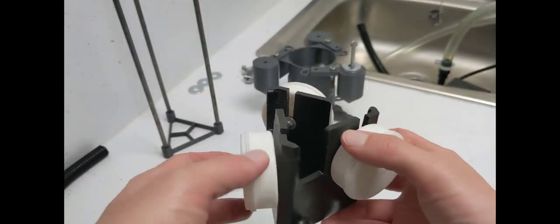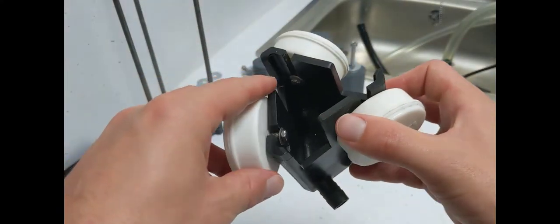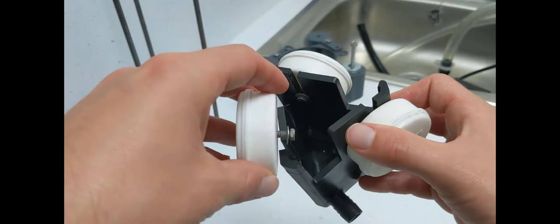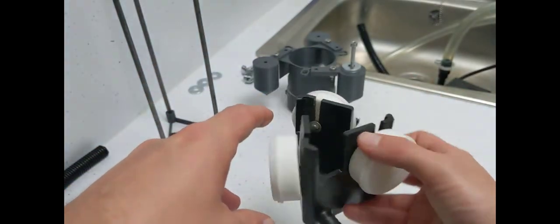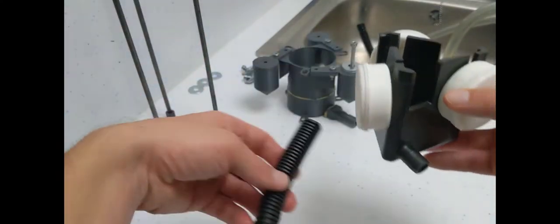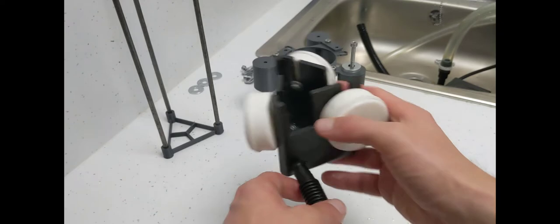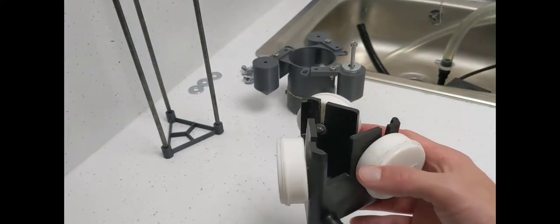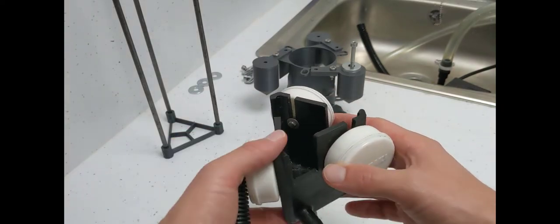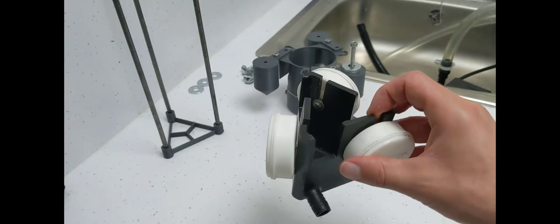Instead, having the outlet on the side means the vortex goes down and sideways, and it just doesn't work — you don't get a strong vortex. The floats are also poor quality. Most other models are triangular with an outlet at the side. The floats are hard to adjust, and when suction comes on and the level changes they tend to tip over because the corrugated pipe and pump suction push the float in different directions, making it hard to keep level. You have to put your hand in the coolant to adjust the nut — it just doesn't work.